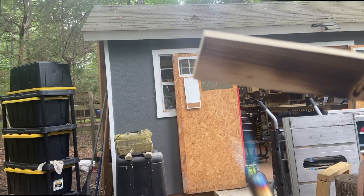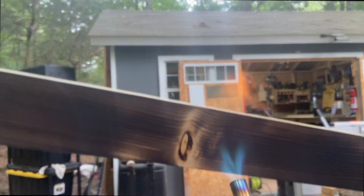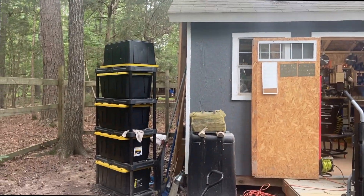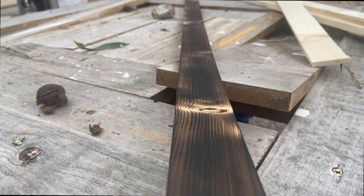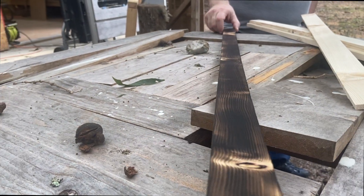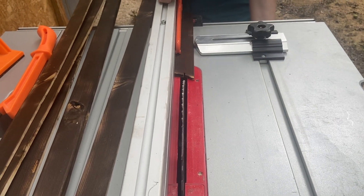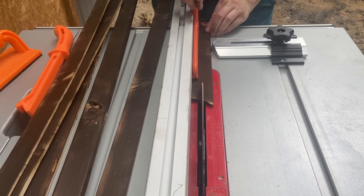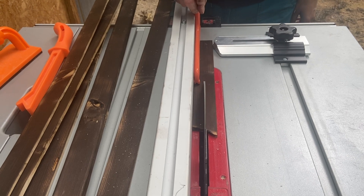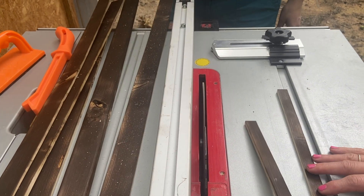We're going to do the burning on all the pieces we've cut. Thin wood like this will have the tendency to curl as you burn it — we were aware of that but we're cutting them into smaller pieces so for our project that is not a problem. We burned them first and then cut in half because if you cut first and then burn, they will have a tendency to curl and become unusable. That is something to consider if you're using the shou sugi ban method.